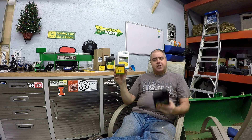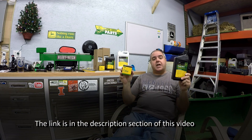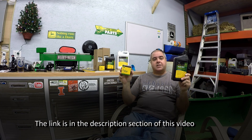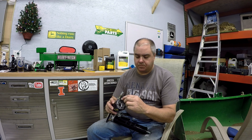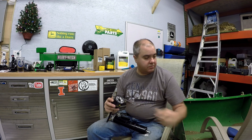The filter is the same one I've always used and as far as I know everyone uses: M806418. You can get both of these as well as all of the other 200-hour service parts at my website TractorTimeWithTim.com — search for the service supplies. There you'll see links to each of the 50-hour or 200-hour service for the 1023, the 1025, the 1026, as well as the 2025 tractors. When you click those links it will add all of the items to your cart at GreenFarmParts.com and all you have to do is complete your order — I do everything except enter your credit card number for you. Put just a little bit of grease on the O-ring with every filter that I put on.